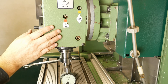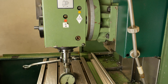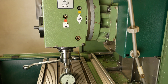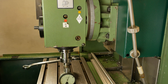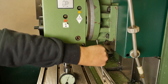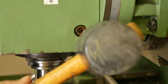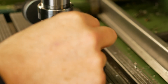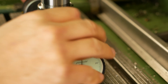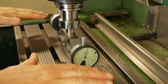We need to bump this around until this reads zero. It's not moving at all — did I get all the bolts? One, two — there's a fifth bolt right at the bottom which I didn't get, that would explain it. So now I should be able to tappity-tap-tap — well, with a rubber mallet it's more of a thud-thud-thud. Zero. And zero. So we're now trammed side to side, which is the easy part.